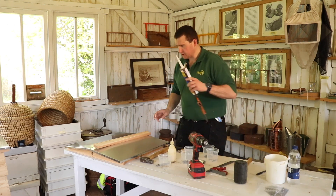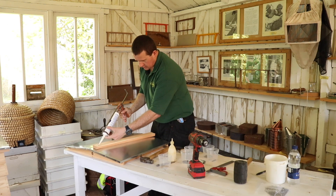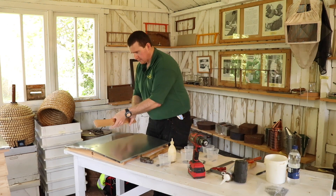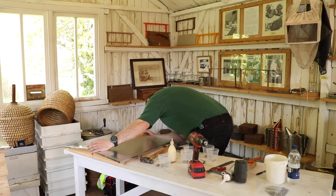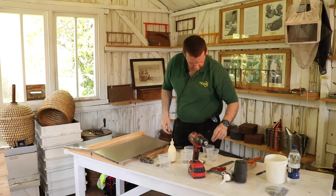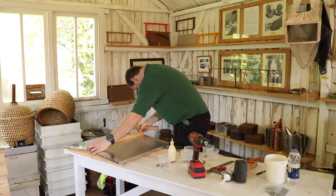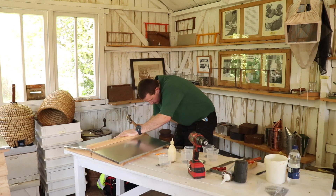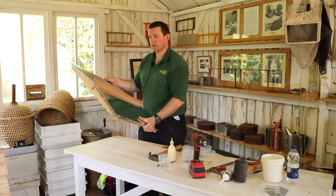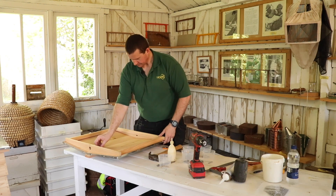On the underside of this you want to be putting some silicone — any kind of external silicone will do. Start at the end and squirt it all the way down like that. Place that on there and on there. Get your two-inch nail and just make sure you're in the right position, happy with it, and then drive it home. And that's what you end up with. Next stage is to put inch nails down there — I usually do about eight.